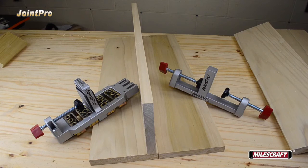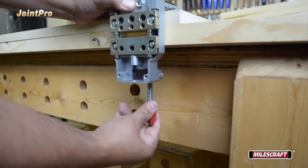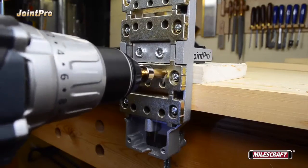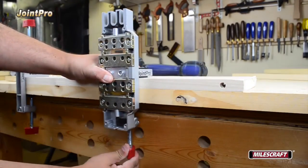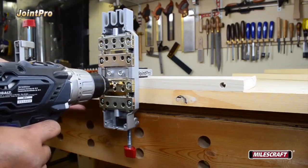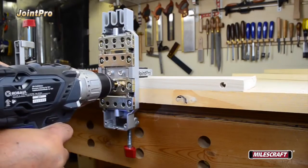For a project where you need a mating component such as a fixed shelf inset from the edge at a given distance, you'll want to create a surface joint. Place both the main and auxiliary bodies on board number one as seen here, tighten the fixed position clamp on both bodies to secure the board to the work surface. With the power off to your drill, insert the drill bit into the appropriate drill guide bushing, turn on the drill, and drill a hole to its proper depth. Depending on the length of the board, you may need dowel pins in several locations. To locate these extra pins, keep the auxiliary body locked in its current position, loosen the clamp on the main body, slide it into position for the next set of holes, re-tighten the main body clamp, and repeat the drilling process.